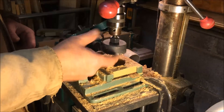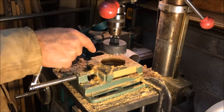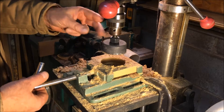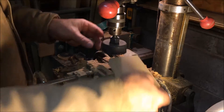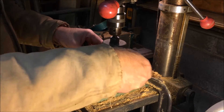I've got a hole saw with no drill bit in the bottom because I don't want a hole in the center — I just want the outer part cut out. I've got it mounted in here right now, I just got through making one. I'm going to do another one so you can see. I've got a little bit of wood up at the bottom so that the hole saw doesn't cut into my vise.